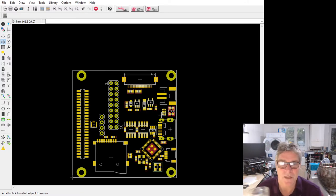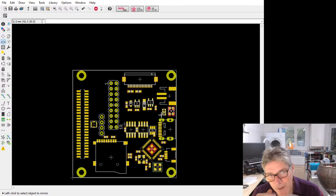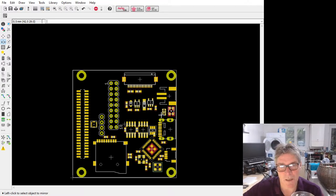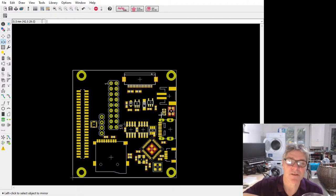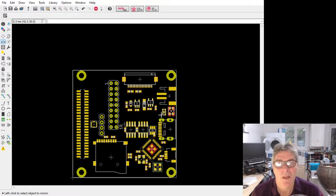So that's probably the way round that I'm going to have these, so that the components are sandwiched between the tile or super tile and the carrier, and they're low profile enough for that to work, with the exception of the components that you need access to. And in the case where they're through hole components, those will actually come into the top.